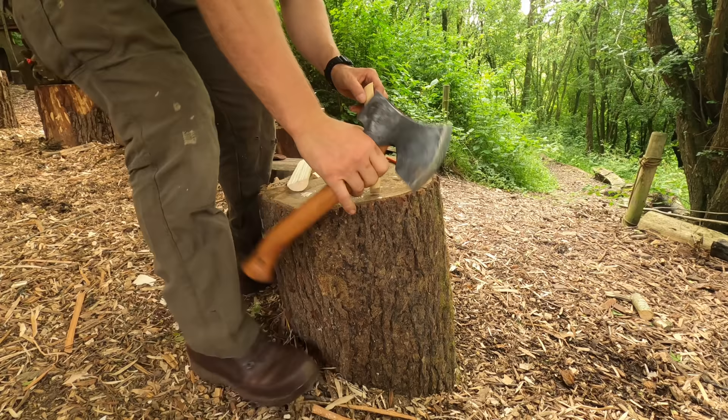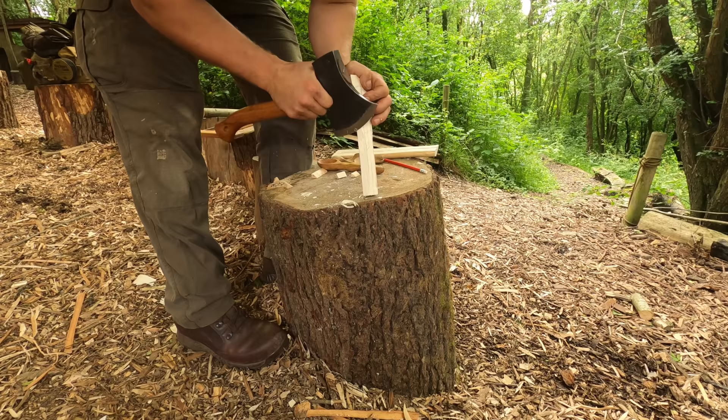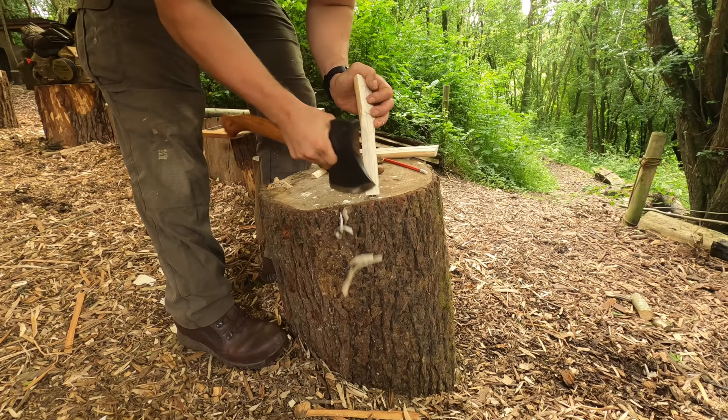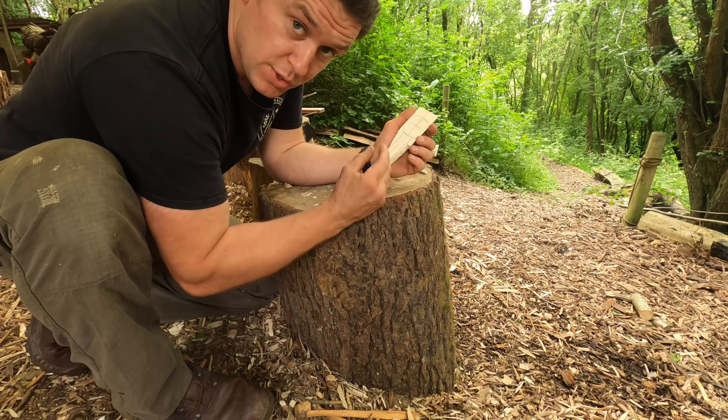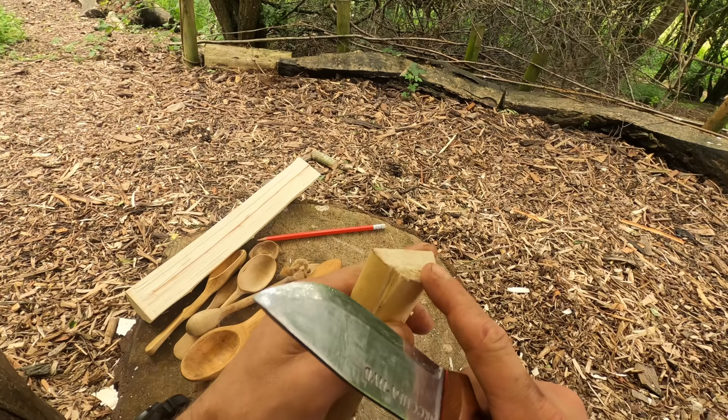The other method uses an axe. With that lovely free-flowing motion you can see how quickly I've brought this in. Being able to put my hand up underneath here I can carve quite accurately as well. So that's quite quickly reduced down the size of my handle. I've kept these parts because there's a specific technique I want to show you in just a moment, and I'm going to go ahead and start to mark off the bowl here.